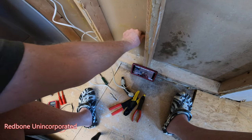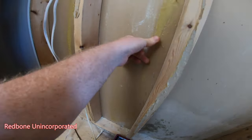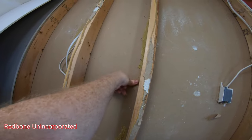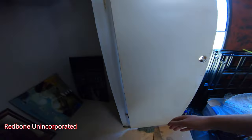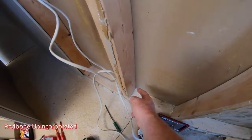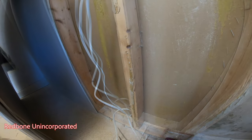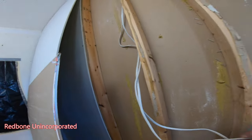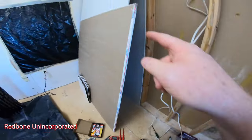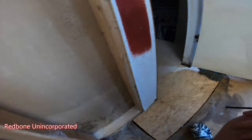across the wall there. And look how deep the other closet goes. I didn't quite hit the stud, did I? Yeah, I'll have to drill a hole in this stud and this stud and then run the wire through. Oh yeah, I got so much wire. It just needs to go to basically here, and I'll cut a hole in this big piece of sheetrock for a plug on this side and one right on the other side,